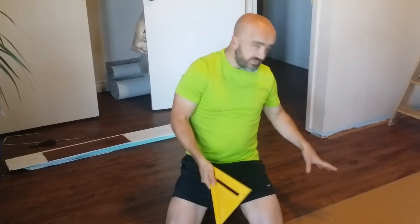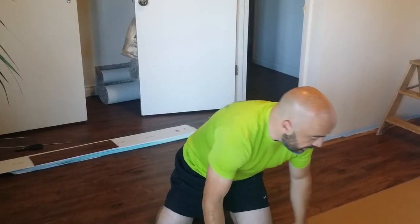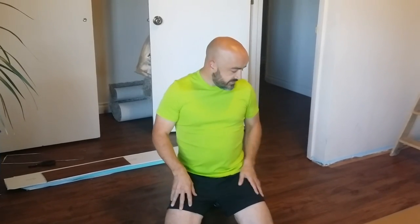Three of the most important things I've found: a 12-inch speed square. This is great because of the way you lay these down overlapping — it's the easiest way I've found to line up where your next one should start in the middle. The instructions on these strips always say to get a big 100-pound rolling press, which we didn't do. We got a rubber mallet, and if you smack it hard enough it sticks really, really well and you have a hard time peeling it up. The instructions will also tell you to get a latex primer to lay down on the floor to help it stick — we haven't found the need on painted concrete, but when I did pull up vinyl flooring in our landing entryway, I laid down the latex and it stuck like you wouldn't believe.